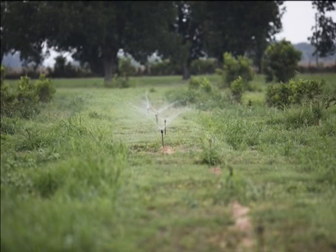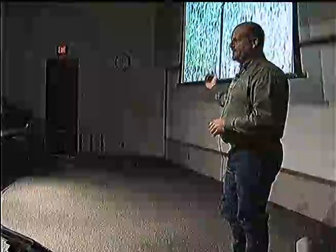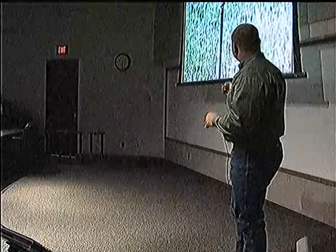Here's another picture — I won't tell you where this is, but it was a research orchard. They put in nice sprinkler heads, then realized they had problems with high bicarbonates and high iron that was plugging up their emitters. So they replaced all those nice heads they were having problems with and made their own — and this is something you do not want to do, because you do not get uniform distribution of that water. You can't control where it's going or how much is coming out of each one. You can see they just put a screw in here because one side was squirting too much water. In this 40-acre orchard, I can almost guarantee the front of the line is going to be a lot wetter than towards the end.